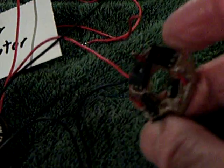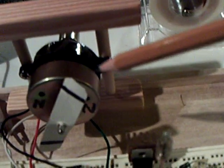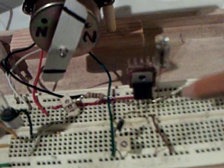It was hard. I took the guts out of it, which is a hall sensor transistor circuit. It runs on 12 volts, but it wouldn't run on anything else. I fiddled around with it and rewired it into a Bedini SSG circuit. That's the little motor right there wired up to a single transistor Bedini SSG standard circuit - you can find these all over the internet. There's nothing fancy about that circuit. I am using a TIP31 transistor, and I'm going to run this on 6 volts here tonight.